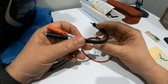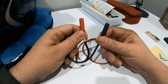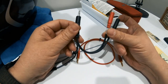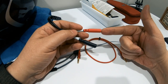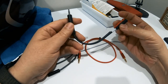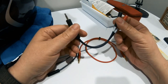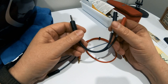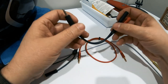The stereo breakout adapter is made to plug the male end into a stereo jack and split the left and right channels out — so one channel goes to one speaker and the other to another. We're actually going to use this in reverse: we'll plug the feed from the Cardo into one channel and the vlogging mic into the other, and it will pass that combined signal onto the GoPro as left and right channels on a single audio track.